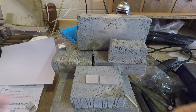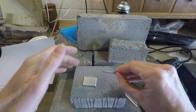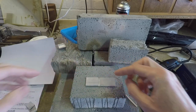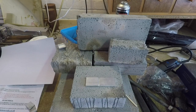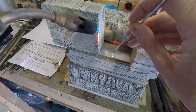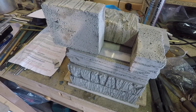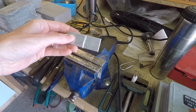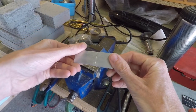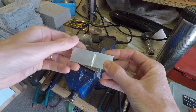I'm going to try a second experiment. I've got two bits of aluminium and I'm going to make a butt joint. I've filed an angle on each one — a V-shaped groove as if I was going to weld them — and I'm going to try and fill that with solder. It's also worth noting there's actually no flux involved in this process; normally if you're brazing or soldering you'd use a flux but this stuff doesn't need any. It also heated up to melting temperature in less than a minute.